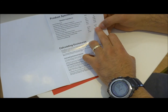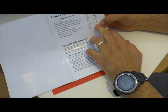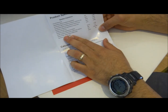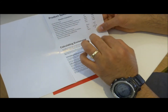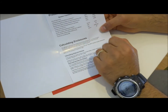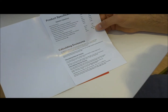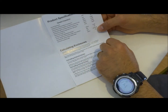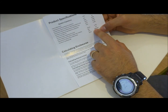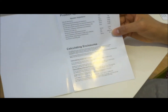The DC resistance is different from the speaker impedance. The DC resistance here is 3.6 ohms, while the impedance is 4 ohms. On the thermal power rating, all speakers show a peak value — those big numbers like 1000, 2000, or 3000 watts. Don't rely on that, because there's no standard for how manufacturers calculate peak power.